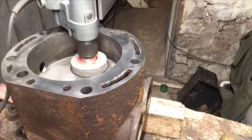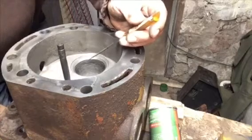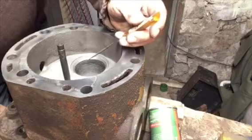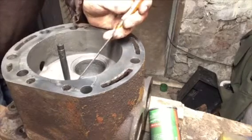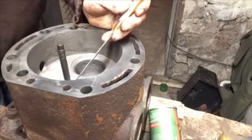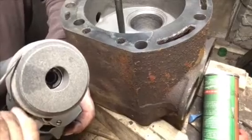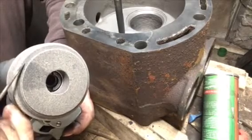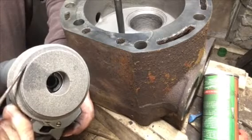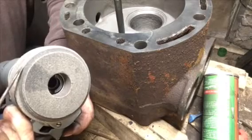We're going to continue with grinding the seats. Now that one looks good, now we'll go to the intake seat. You can probably see this one is the same — there's the exhaust seat and there's been one cut and pressed in, because you can see the telltale sign of a machining lip there, and also distinctly around the top. But the intake has no signs of a seat being cut in at all, it's just cast as it was cast from the factory. Now I want to show you something — you can see on the stone where it's loading up. Depending on the alloys in the valve seats or the cast iron, some of them will make the stone load up like that and then it doesn't want to cut much anymore. So I have to dress the stone more often to get it cleaned up so it cuts better and faster without making the grinder work so hard. I gotta redress the stone again and go back at grinding the intake seat.